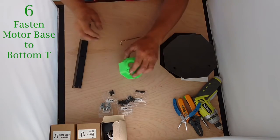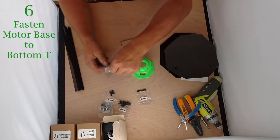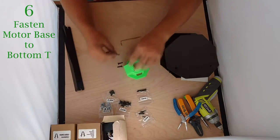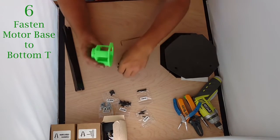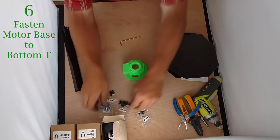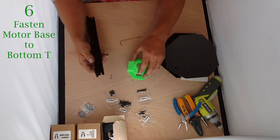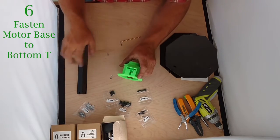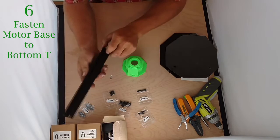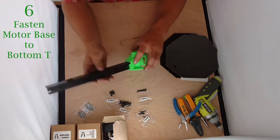We're going to grab our motor base. The motor base is going to fasten to the tee with three 16mm bolts. I'm going to insert these in the back of the part — a nice press fit in there — and take out three nuts. This is where orientation is important. You can see there's a small square where the wires come out of from your stepper motor on this side of the part. You want to make sure that your wire holders are on the same side as that square — this is going to be the proper orientation.